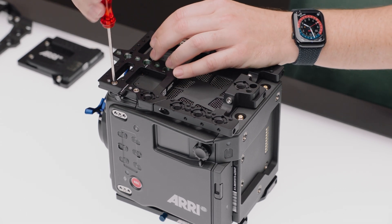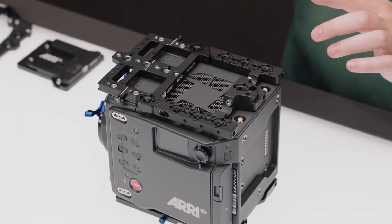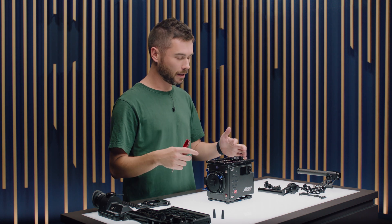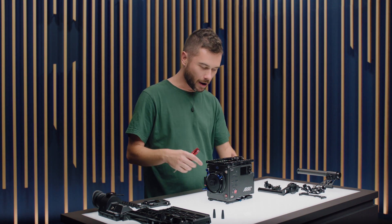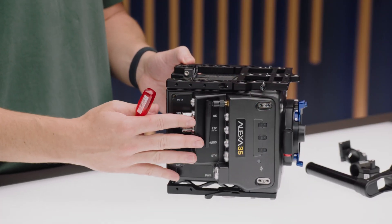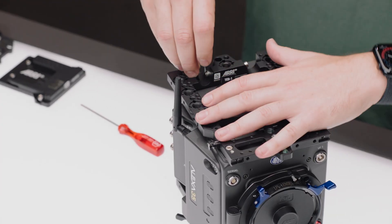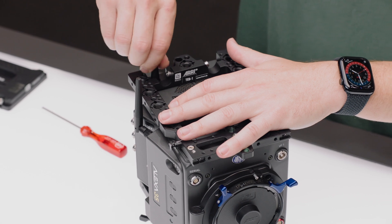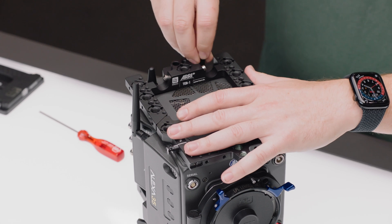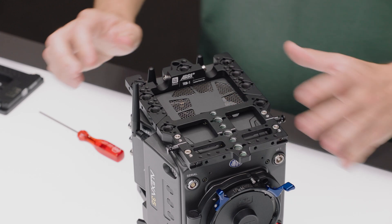The TEB1 does a couple of things. It gives you a lot more accessory mounting options. And if you had one of the articulated mounting plates — which is in the production set and can be bought separately — it would mount perfectly just here, so that when you're running a transmitter on the side of the camera, you can flip it up and out of the way to still get access to the ports. It's a pretty cool new idea. Now is probably the time to put our antennas back. If you have to pull off the Wi-Fi antennas for any reason, I'd recommend that you turn off the Wi-Fi in the camera. Just make sure those are finger tight.